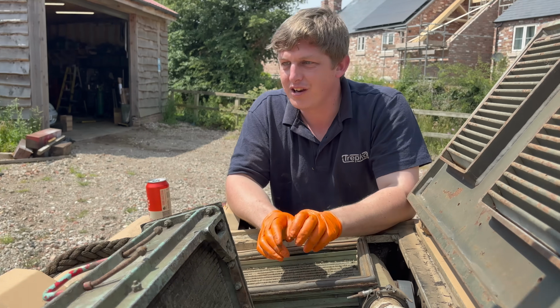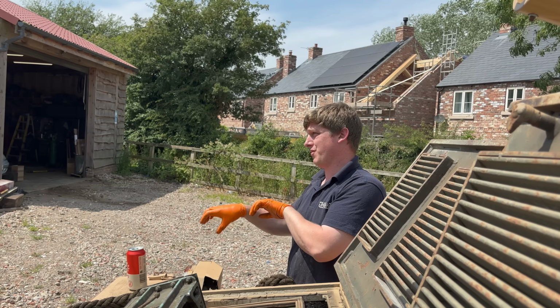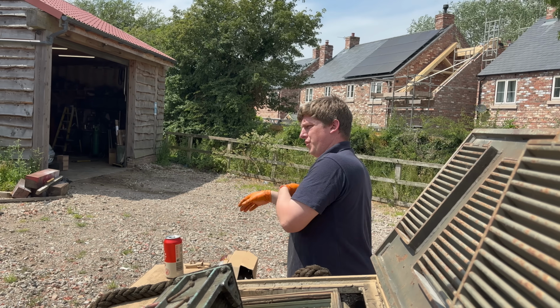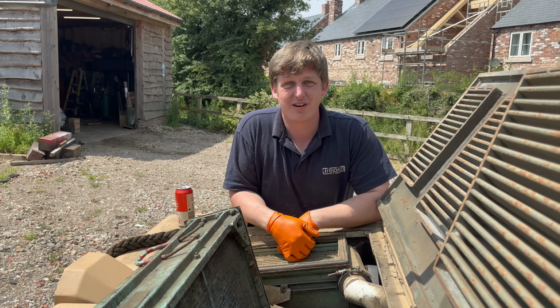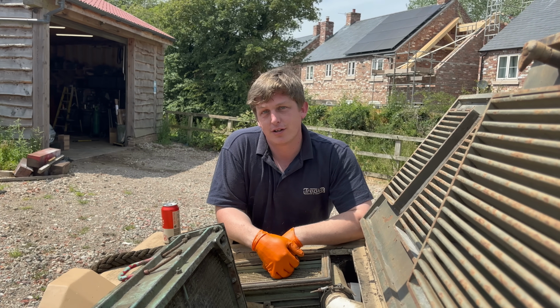So if you'd think you'd pull like in a 432, you pull the right tiller, it brakes the right steering band and turns right. In this, you pull the right, it turns right, but it brakes the left caliper. You're pulling with your left hand. Maybe that's the problem. I'm not going to pretend. Some sort of magic, really. I think the best way to look at these engines is magic.